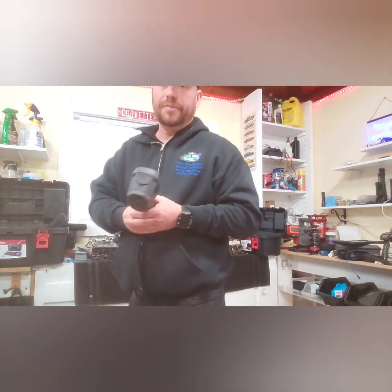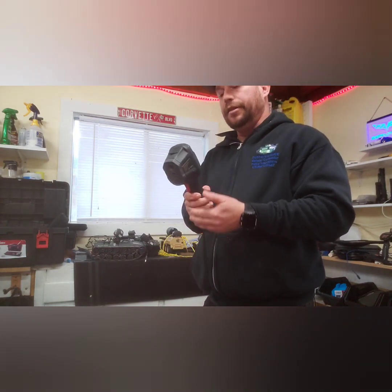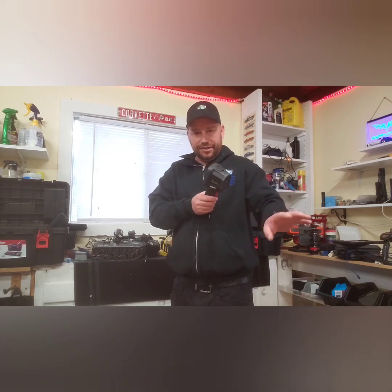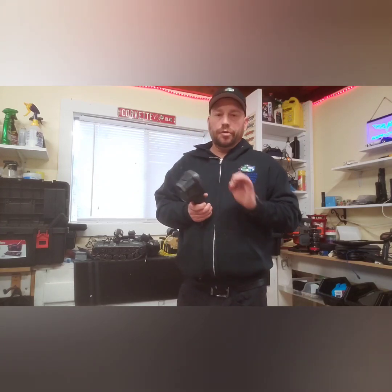This right here is a thermal imager, which is pretty standard — I think every home should have one. I use it to check for water leaks, ducting leaks at registers, and to show what's actually working. For example, I'll show the dishwasher is working during the rinse cycle by showing hot water. Same with the oven and HVAC equipment. The important thing about my reports is not just what's not working, but what is working — that protects the seller as well as being informative for the buyer.